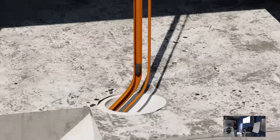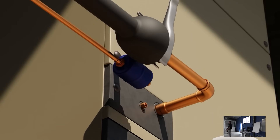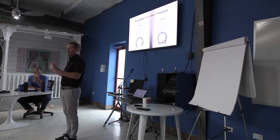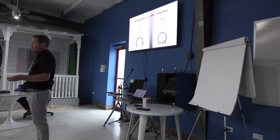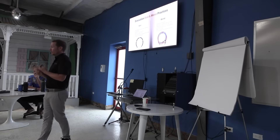Line dryers are really important, and you can get away with a lot if you have properly installed line dryers. You're in a coastal market, which means line dryers really need to be going inside — as close to the indoor metering device as possible. That helps protect from weather, keeps it from corroding out, and protects the metering device from whatever is already in the lines.